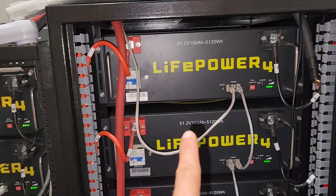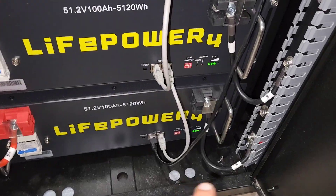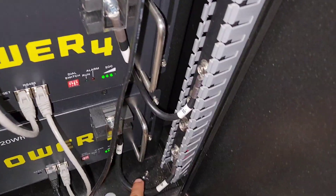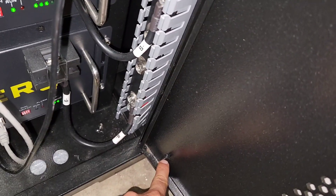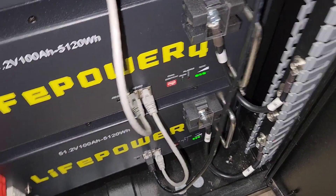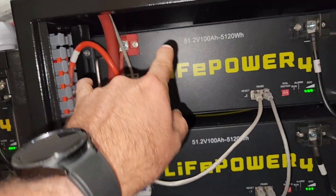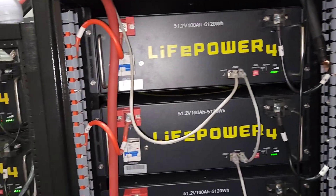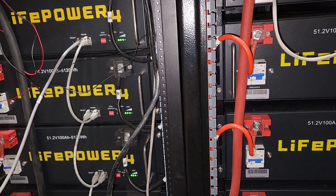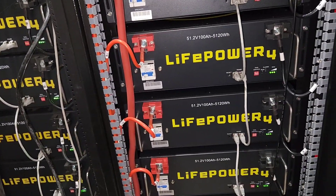This rack is also sturdier — it comes as one piece, everything is welded together. It has extra grounding straps if you want to add grounding lugs to the door as equipment grounds. There's one at each corner, a couple on the back, so if you have the desire to connect your equipment grounds to the case, you can — there are multiple locations to do it.